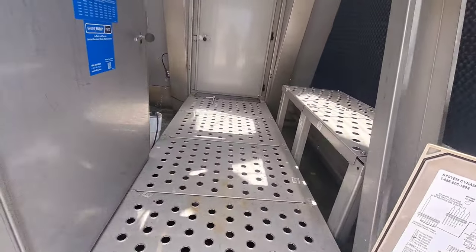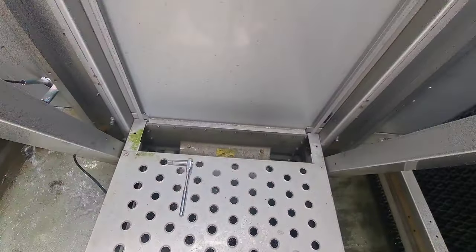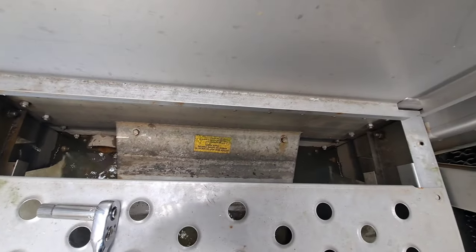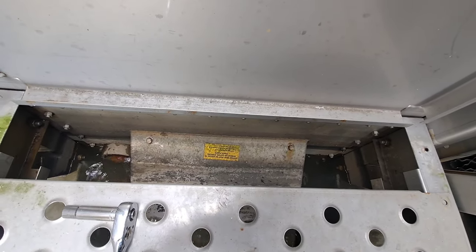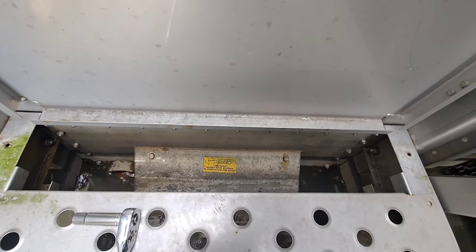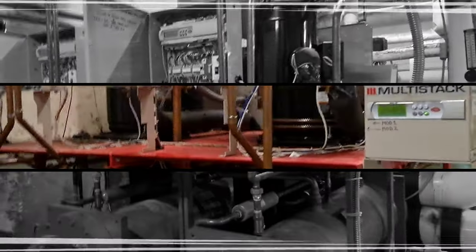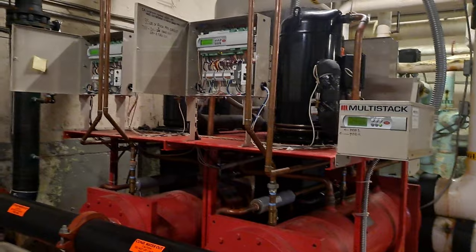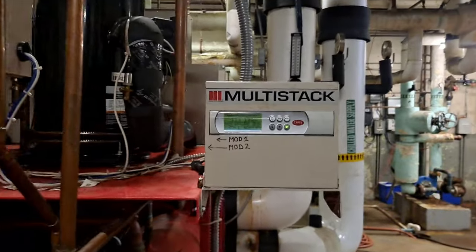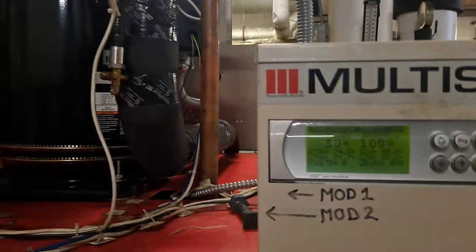On this particular tower, they have these two screws right here, and that is for air removal. They had quite a bit of air in them. I've already bled it, but yeah, just moving and grooving. Finished purging all the air, got all the water filled in the tower, getting the chiller back on. And there she goes.